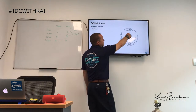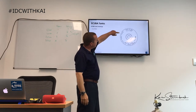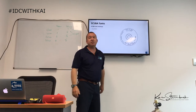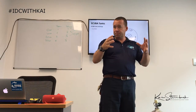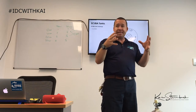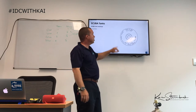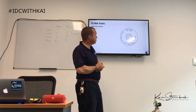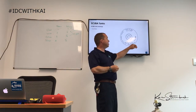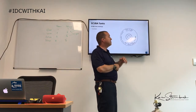Here's an Australian example: AS1777 is the Australian standard, tare weight 14.26 kg, working pressure 24.0 megapascals at 15 degrees Celsius — that's 240 bar at 15 degrees Celsius. Remember, temperature affects pressure: if the tank heats up, pressure increases; if it cools, pressure decreases. So the working pressure is specified at 15°C. Test pressure is 36.0 megapascals, water capacity 10.4 liters, plus a serial number.